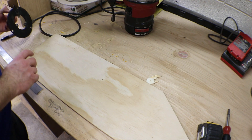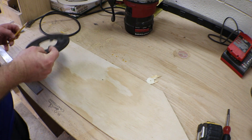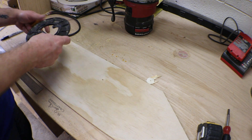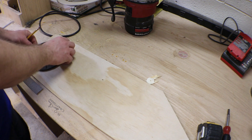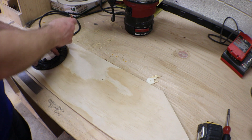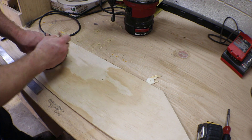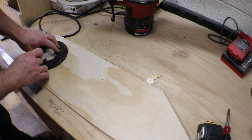The first thing you're going to want to do is take the base plate off of the router. Most routers already have this base plate. If you don't, you could just set the router on here and do the same thing by tracing it out. Take your pencil, trace this circle out and then trace all of the screw holes out.